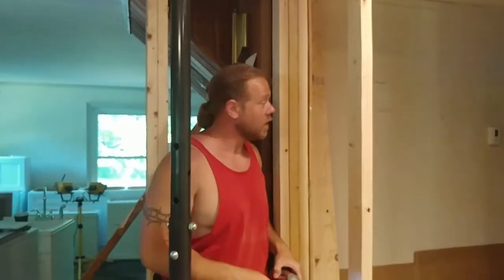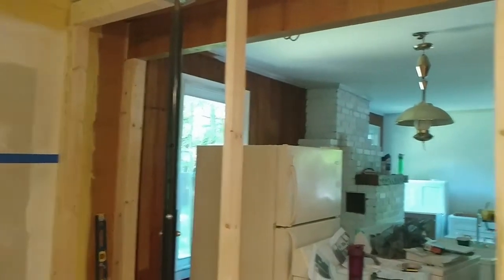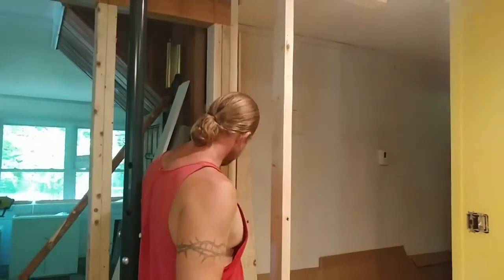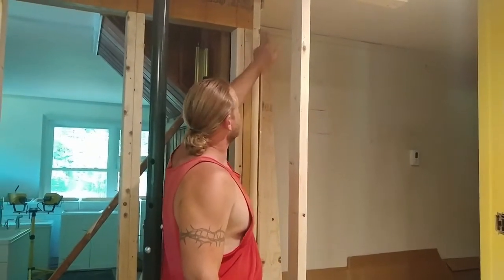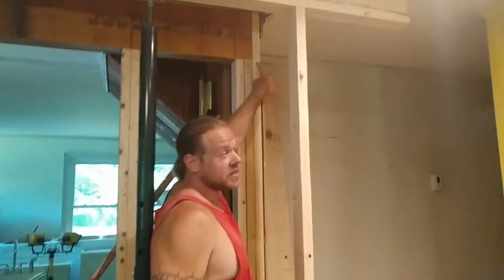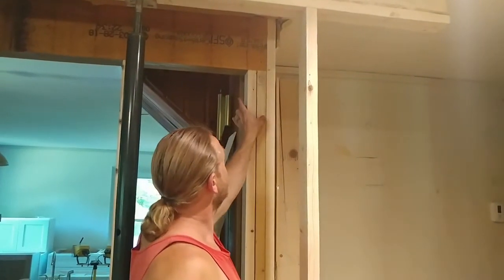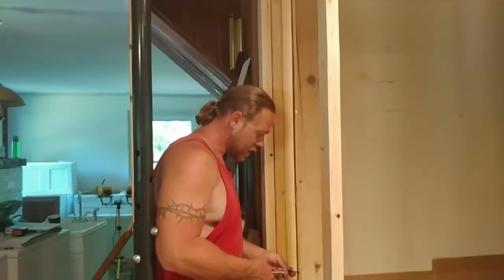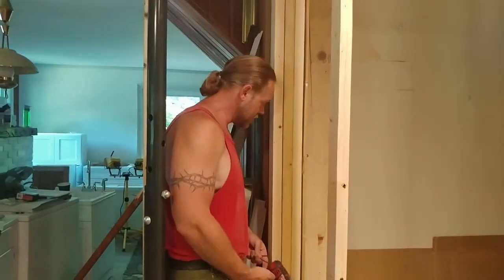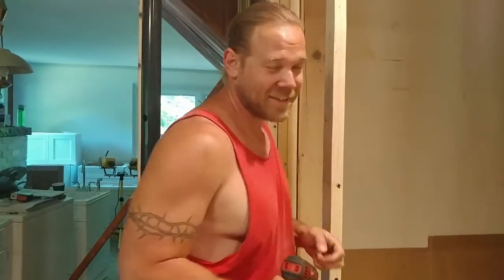Okay, it's starting to heat up in here. This is where we're at right now — we put up our beam. We went over the engineer report and he's calling for two jack studs. We've got this — this is what I was telling you about previously. This is a king stud, floor to ceiling. Two jack studs holding up this micro-lam, and this thing is not going to go anywhere. So the next thing we're going to do is screw this off, then take out this jack.